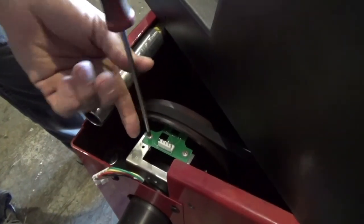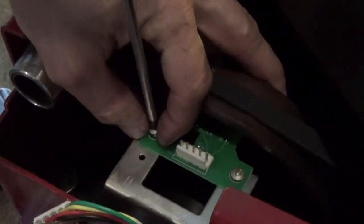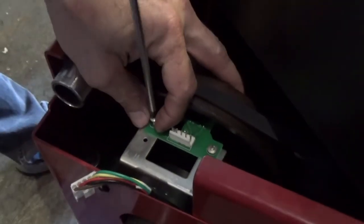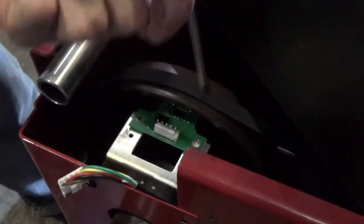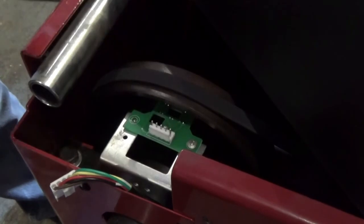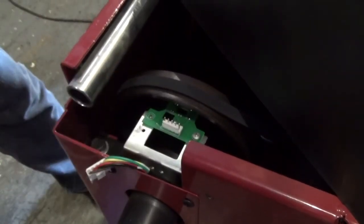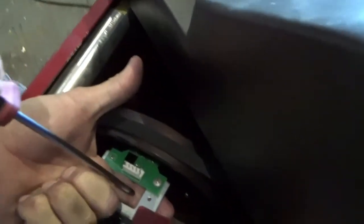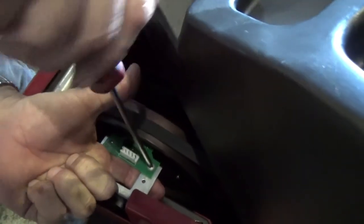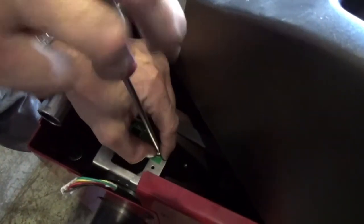And here, you have to disconnect those two bolts. You have to be careful, sometimes those bolts are too tight. So don't apply force down because you are going to lose the calibration of this plate. If you need to apply force, you have to hold it from inside with your finger, okay? Because I'm going to explain now why.